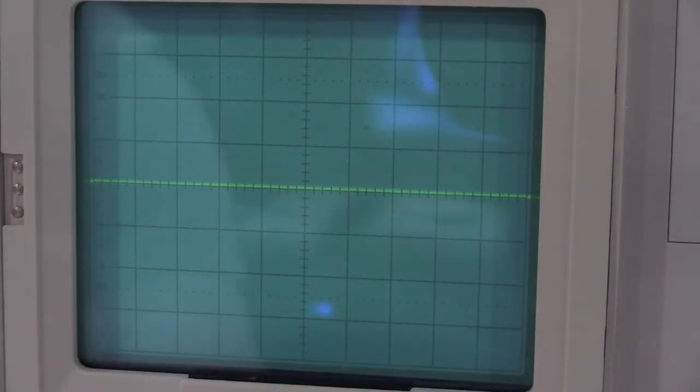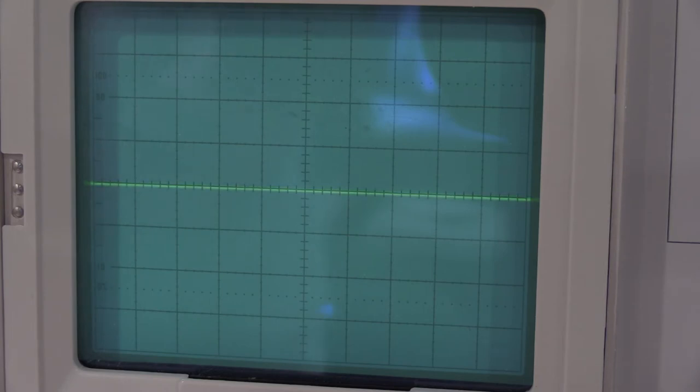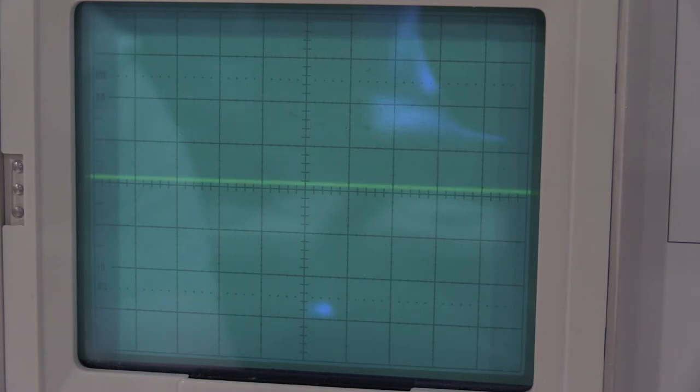Do that to channel 2 real quick. Leave it on 5 millivolts for channel 1. Actually, it wants me to do 1350. So this is the variable. Pop that in. Now they want, as I'm rotating this completely end-to-end, you can see it moving just a little bit. And that is perfect. That doesn't need adjustment at all. I'd probably say less than 0.1 divisions, maybe a 0.01 or a 0.05. So that one is good. Now we switch over to channel 2 and do the same thing. There will be a lot of that because this is a two-channel plug-in. It's just do what you need to do and then do it on the other channel.